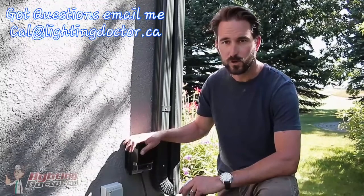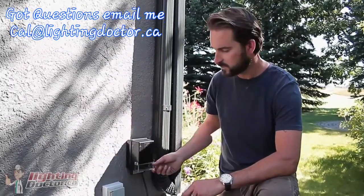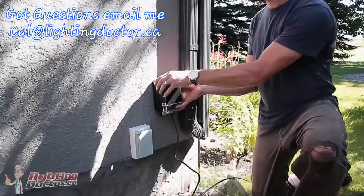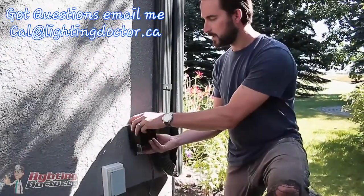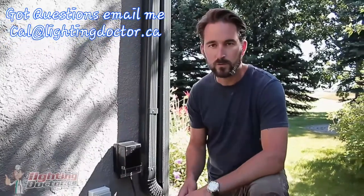We're going to use a 60-watt transformer here from Kichler, which is really simple to use. It's got a small timer on it as well as a photo cell, and you can see we basically just mounted it to the side of the house with a couple screws. Once we get all our wire laid out, we're going to wire those into here.